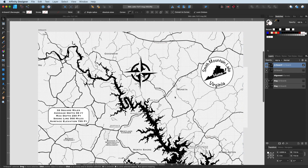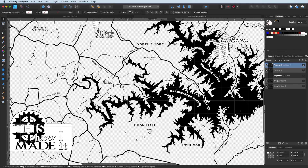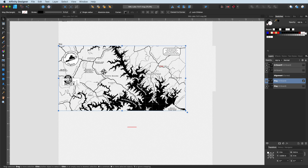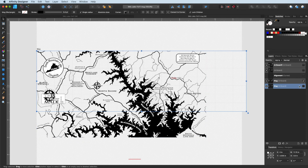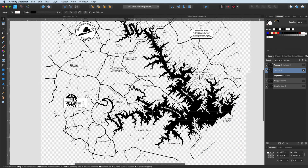If you watched my last video, this should look familiar. I'm not going to go into anything that was covered in that last video, so consider this a part two. Let me go over some of the updates and changes I've made specifically for laser engraving onto this steel with either a paint or a powder coat covering. I've copied all the components in this map to various artboards — one for a 12 by 12 square, one for a circular one to etch and cut from acrylic for an uplight LED project, one for that thin mug at 5 inches tall, and one for the larger mug where I can only engrave the top at about 3.5 inches tall. This allows me to rearrange elements like logos or the info box based on the size and shape. The downside is if I fix something, I need to fix it in each artboard or recopy and replace it.